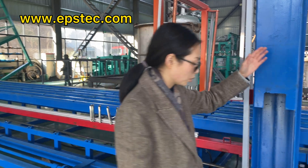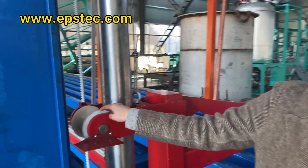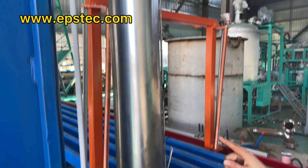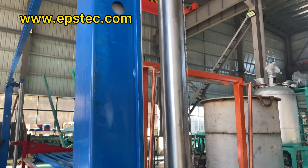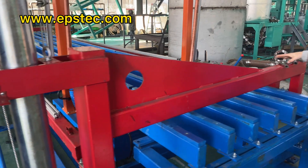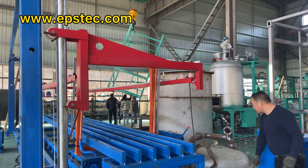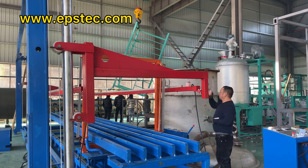The second function is vertical cutting. The vertical cutting is driven by a timing belt that moves the whole cutting frame up and down to cut the EPS block from one big size to small size. The EPS foam cutting machine you see in this video is 6m long. It will cut one big EPS block to smaller sizes like 500mm or 1000mm.